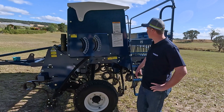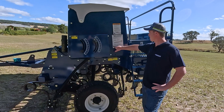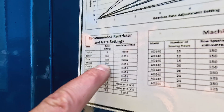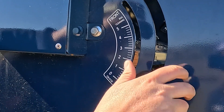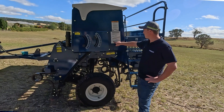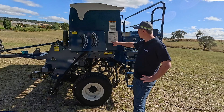We'll refer back to the calibration chart. Today's scenario we're going with wheat, so we need a gate setting of 0.6, which has been set on the other side of the machine via the gate levers. We need to fit two of four restrictors, so now we will go and set that.